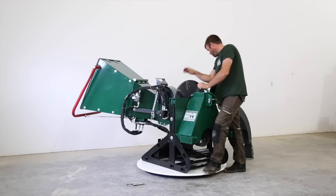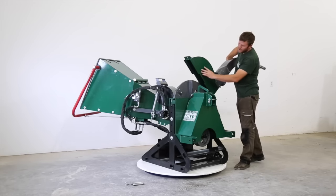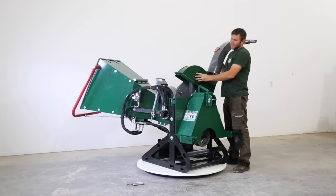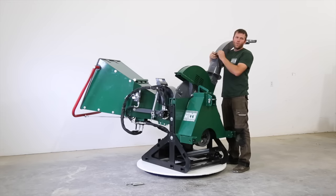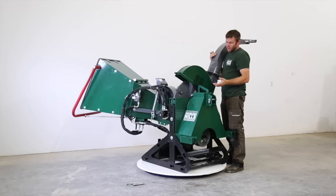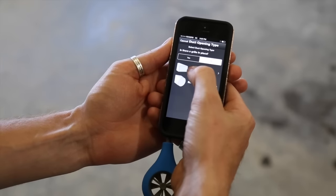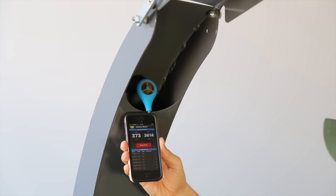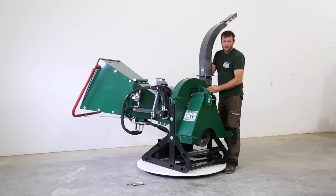So when we look at the clamshell now, we can close it. This is our air inlet, and we did a lot of work on balancing our air to make sure we had enough coming in but kept the noise inside. Some of our theories were to let as much air in as possible. Well, it doesn't help flow, and we have flow meters and we tested the outputs and basically determined that in here we made the least amount of noise. We maximized our air, and it does everything we need it to do with our air intake tucked right in here.